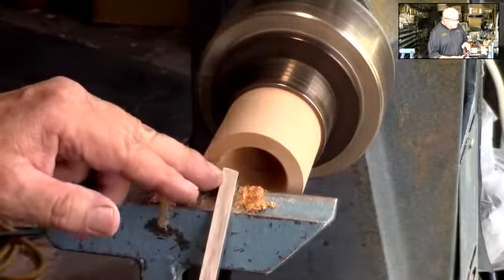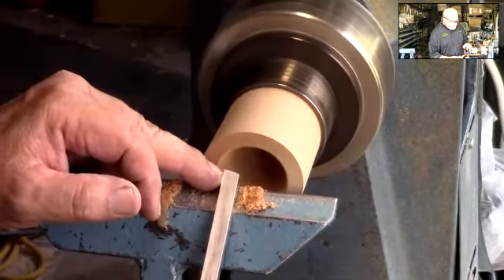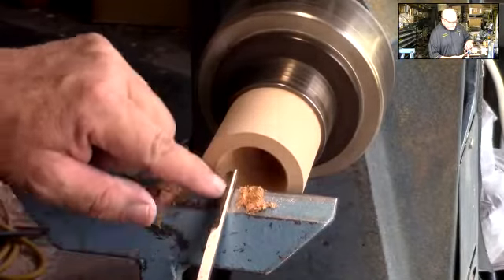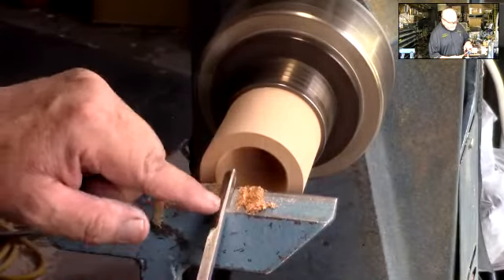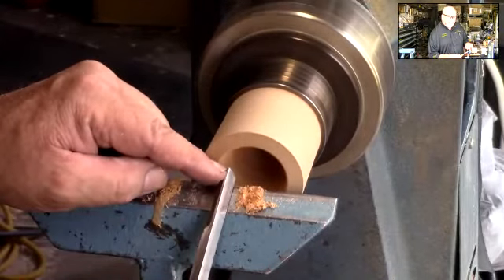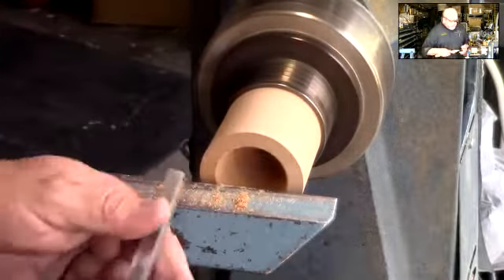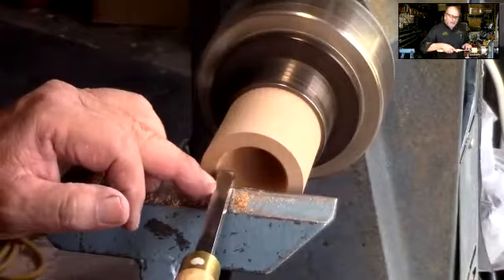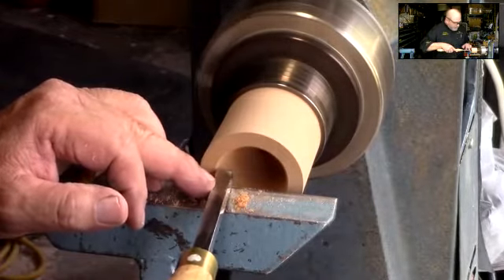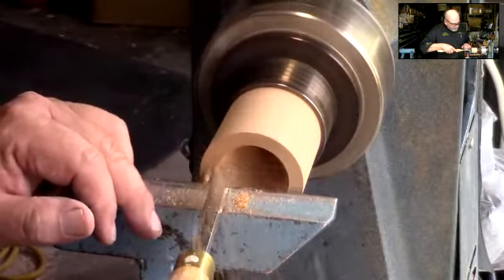Mine is less than 90 degrees, with a radius off to the right hand side. It has an undercut or a relief cut partially down the side, but it doesn't grind all the way to the top. That way I know where the tip of my tool is when it's buried back in the blank. The handle comes up to where I am just above level, and I'm just above center as I cut. With this tool, I plunge straight back.